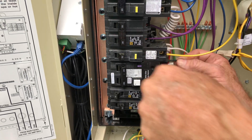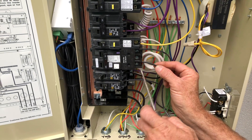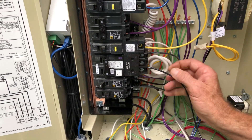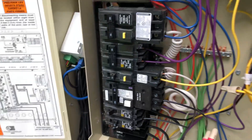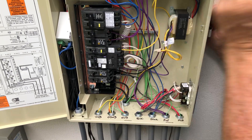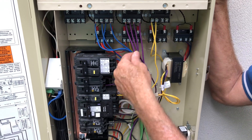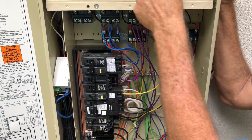I always pull on the wires to be sure they're seated well when you do this sort of thing. The neutral line always gets tied to the bus bar right here, but we don't have a neutral line on this one because we're just dealing with 110 — and that's all wired in. If we have any other 110 items to wire in, we just replicate this setup. For 220, we replicate it like we did earlier and use the other relays. These are all controlled by the buttons up here.